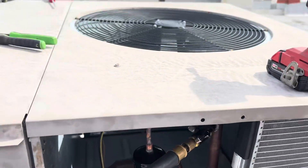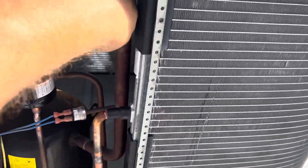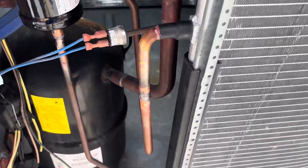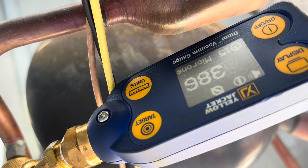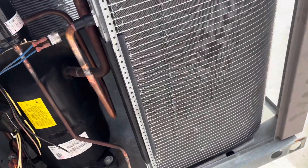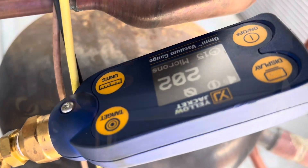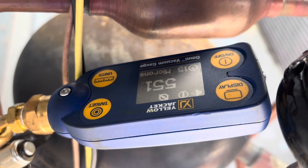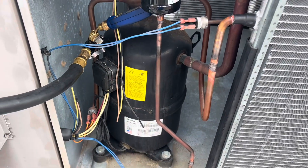Alright, we got the vacuum going, we got the lid back on. Just keep this tight, we'll be alright — it keeps wanting to back out. We'll be down too, about 386. Had to pull for a while. Alright, not bad — got her down to 202, and then 548 with the pump off, 551. That's not bad for a service vacuum, I'm pretty happy with that.